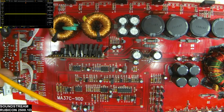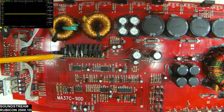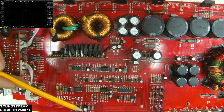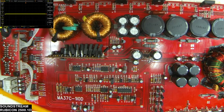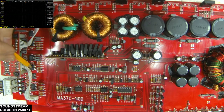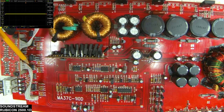If you ever have a direct short between your positive and negative 15-volt voltage regulators — for instance, when I soldered this board in I had a solder bridge on the plus/minus 15 volts on the card and this capacitor literally blew off the board. That shorted out the JRC 4558 at U5. So if you ever do short out that plus/minus 15 volts, check U5. On the thermal camera you'll see it gets extremely warm when powered up if you don't have any drive on pin one of your card.